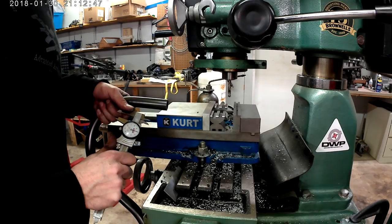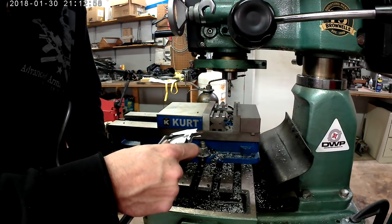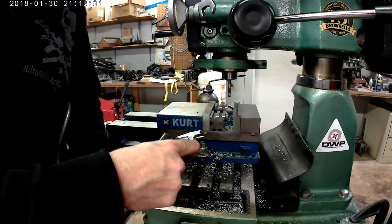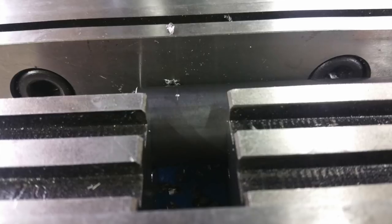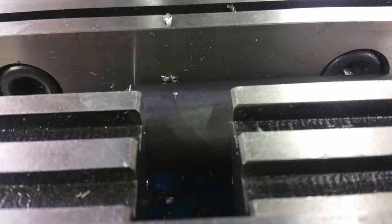This is a little trick that I do. Just measure the distance you want the hole, set up the mill to drill at the right radius, and just do a peck mark, then see if your peck mark lines up on the hole. If it's there, you're good — proceed.